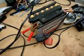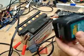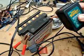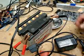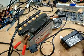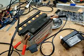I hope it works on yours as well. Good luck. I would encourage you, when you put this thing together the first time, do like I'm doing, just plug it into an old battery or something. I wouldn't connect it up to your Ferrari on the first try. Make sure that it's not putting out too much voltage. When you first do it, if you put a voltmeter on the plug, you will read 0 voltage, because what it does is it senses the voltage, and it won't put out any power until it senses a battery that needs charging, and starts charging. I hope that's helpful to you. Again, proceed at your own risk, and good luck.